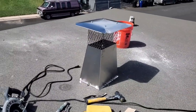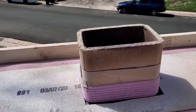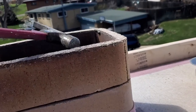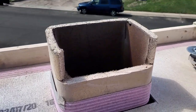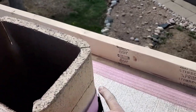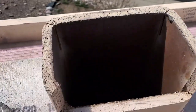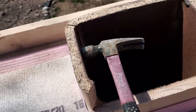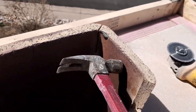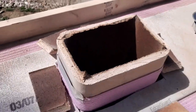In this case we're going to put a flue stretcher on top of this flue. We noticed we're going to have to cut this flue down, and we wanted to do that today. So we cut a horizontal line and then cut down each corner, then just take a hammer and tap it. If you ever have to lower a flue tile height, that's a very easy way to do it — cut a horizontal line, cut down each corner, and tap from the inside out, and the pieces will just neatly fall right off. There will be some jagged edges left behind which you can dress up with your four-inch angle grinder with a diamond blade.